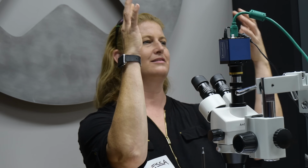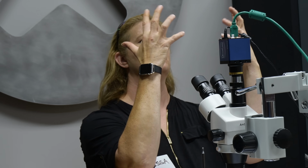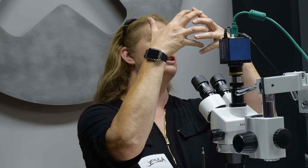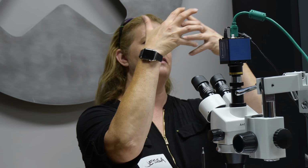So a normal capacitor is on a circuit and it has one foot on ground, and then it has an insulation space, and then it has another foot that is on whatever circuit is on the line. If you were to get out your electron microscope and see how these little ceramic capacitors are built, you would see that the side that's on the line and the side that's on ground have little metal plates that come very close together, but they don't touch. So there's an insulation space between them.